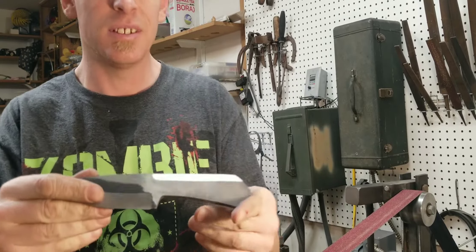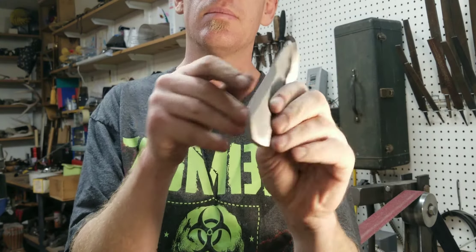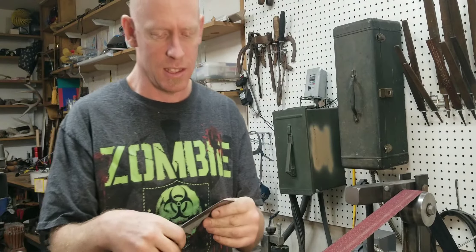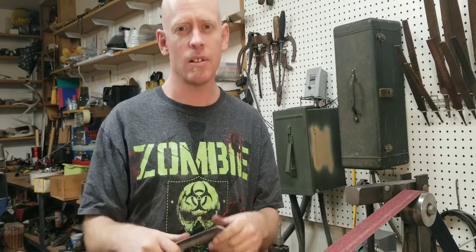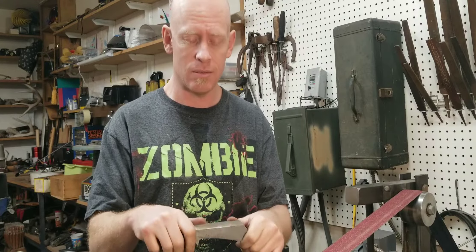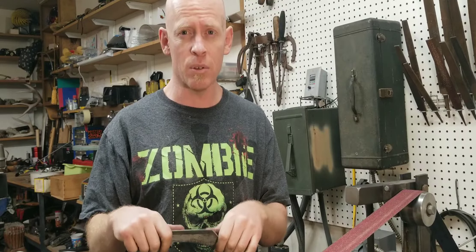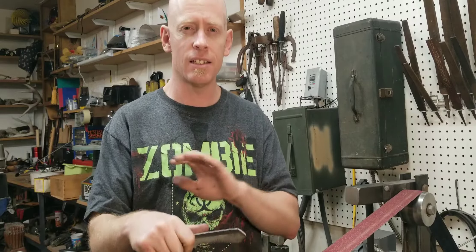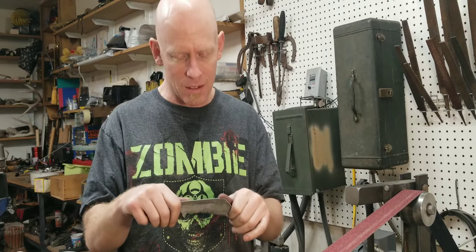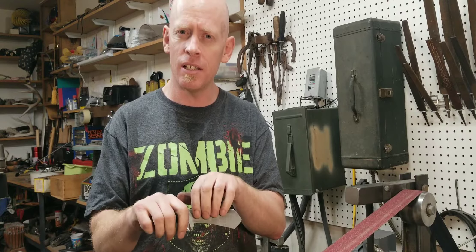And finally I believe I'm making a little bit of progress — starting to feel it, starting to be able to feel that contact. I practiced that for quite a while, just sitting there and touching it, looking at it. Not even grinding a bevel, just making that contact, trying to learn how that feels — when it makes perfect contact, when it hits flat, when you're not grinding into the edge or digging into your bevel.